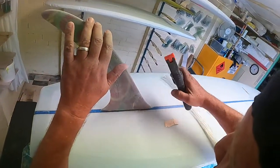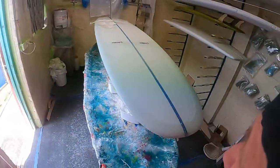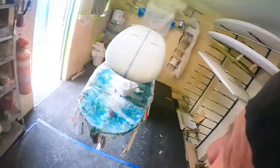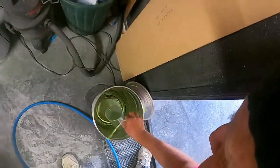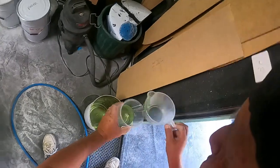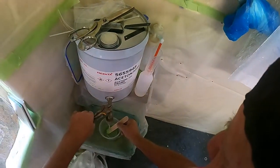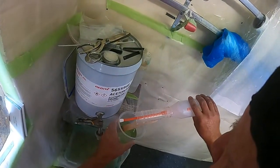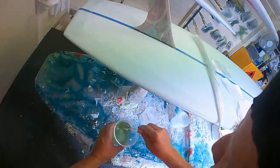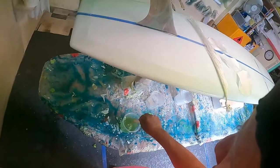Right, I'll take this off. Let's check that it's nice and straight — good old cheap plank. That looks beautiful, that looks really good. Doesn't need a lot of resin. Now the little trick we do — we just put a dash of acetone in, not heaps. That'll evaporate, but it'll thin the resin enough to absorb the rovings, and then it'll evaporate. It's a little trick we do.